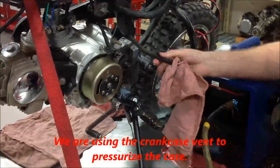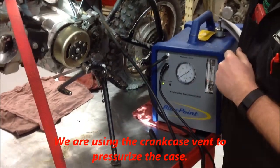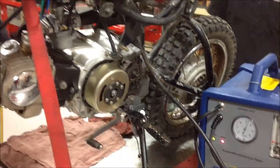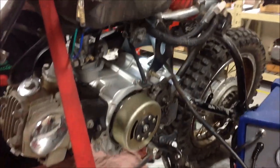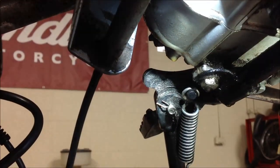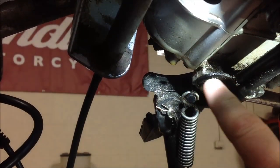We're going to go ahead and look at a place on the vehicle to hook this up. Let's go ahead and see if we can get her to smoke. What works better is to have the lights off and then use a flashlight — that smoke will literally almost glow. Now we're going to look and try to see if we have smoke coming out. Oh, there it is! The oil is actually pushing out right now. That drip got bigger and then, as the pressure built up, it pushed right out.